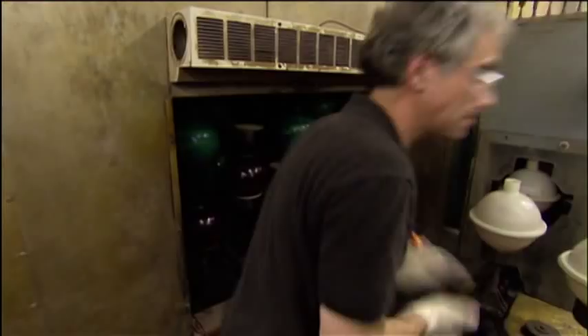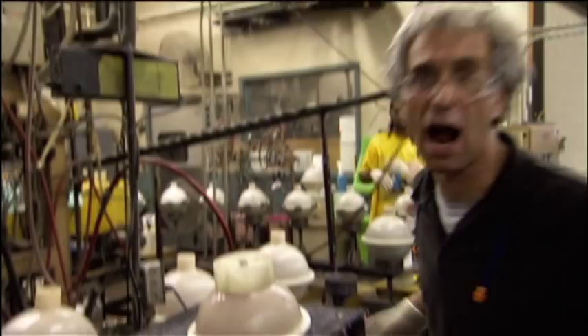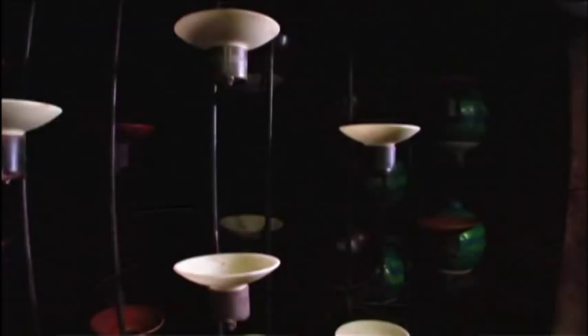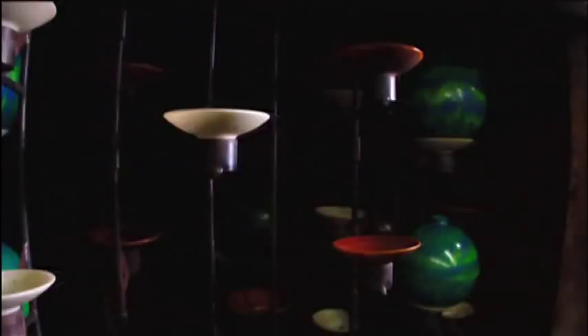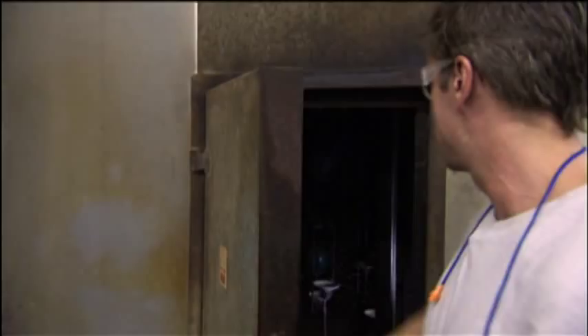The plastic urethane outer shell is still forming. The chemicals are still reacting, and this ball continues to get harder and harder. In the oven, the veneer cooks and the plasticizer continues evaporating to achieve the right porosity. The more porous it is, the better the performance.